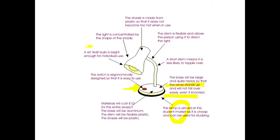And equally important is, you see here something called a 60 watt bulb, because it's an old thing. This also is about maybe 25 years old. At one time when we specified luminaries, we talked about the watts. Typically the wattage is somewhat loosely proportional to the amount of light that we need, around 30 to 50 lumens per watt was more than sufficient. But then the unwanted thing is, a 60 watt incandescent bulb probably dissipated 59.999 watts all around as heat.